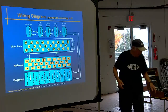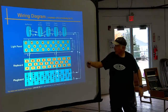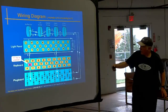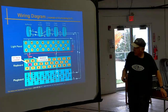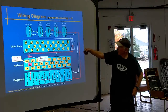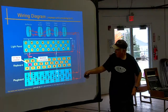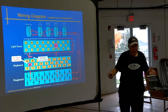Here's the total wiring diagram of the Enigma. The battery is here; when you press the letter A button, the battery supplies voltage, which comes down through the plug board on the front, goes up into the rotor stack, through the rotor stack, back through the rotor stack, back through the plug board, and it lights up the letter H.